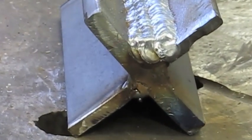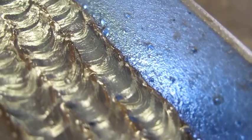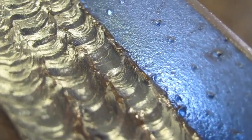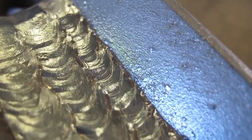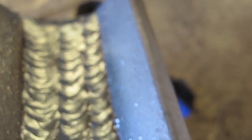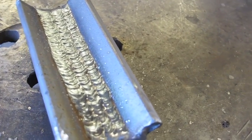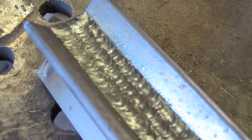Here is the end result of MIG welding thick material. We have a succession of beads overlapping in such a way that we have good fusion between them. Except for the ripple pattern, you might actually think it's one big giant bead — and that's the idea to get good fusion. Thanks a lot for joining me on this one. Don't forget to order your official Weld Fever logo cap, available at www.weldfever.com, and don't forget to like and subscribe. See you on the next one.